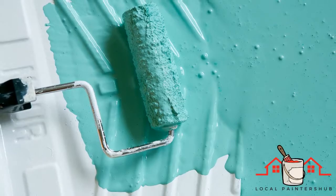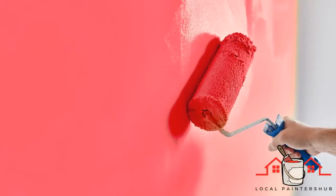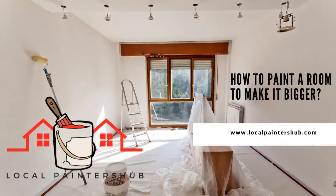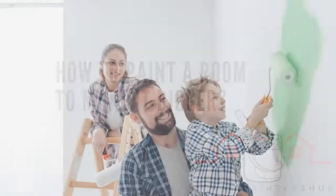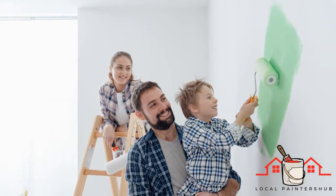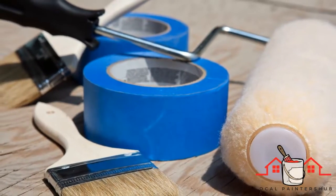Now, I also know that you can't wait to get started with painting your walls, but before we go ahead and paint the wall, take some time to inspect areas of the walls that will require multiple coats to paint over old stains of crayons or any wall writings. If there are any areas spotted with stains, make sure to put stain block over the crayon, so you do not end up putting 5 or 6 coats of paint on the interior walls you are painting. The trouble with painting too many coats of paint in an attempt to cover up wall stains is that the paint begins to bleed and show the emulsion, so to stop that from happening, use a suitable wall stain remover.